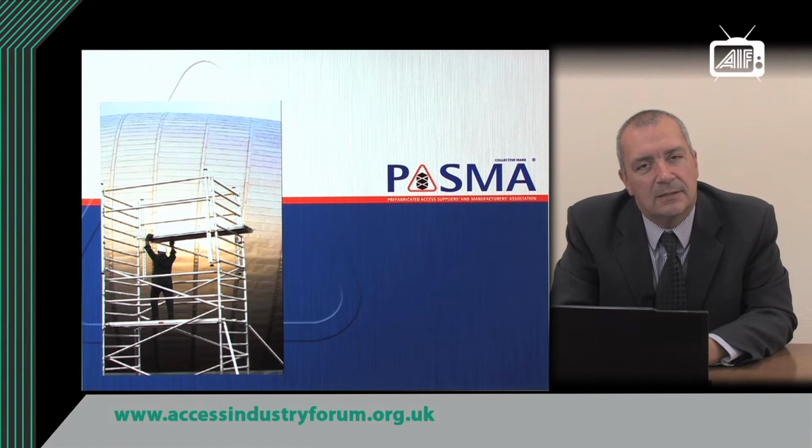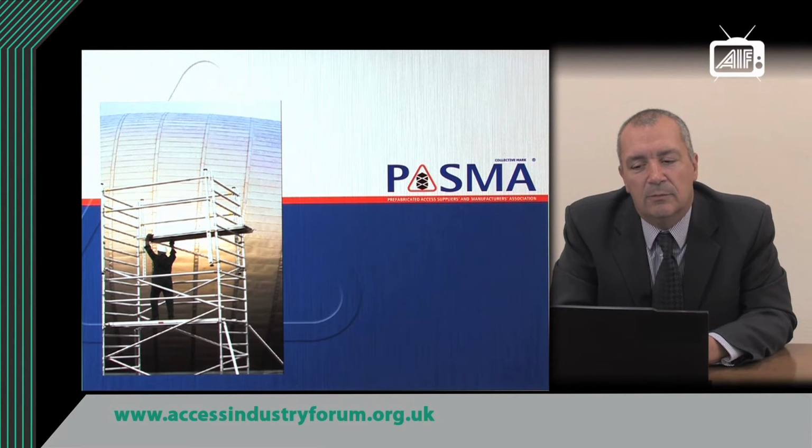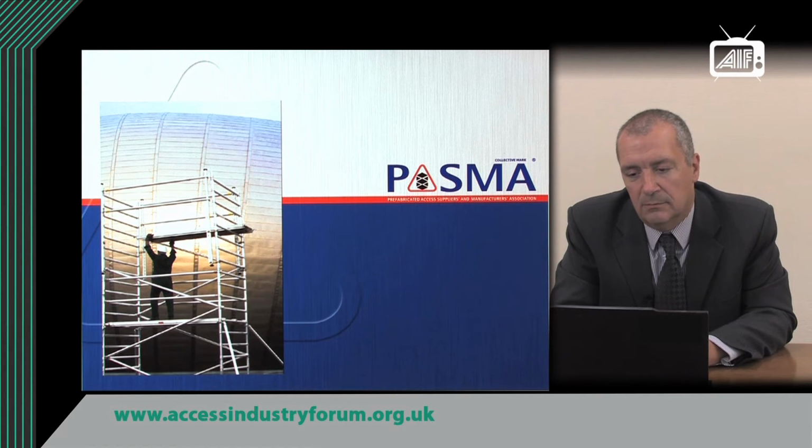Mobile access towers are different to fixed scaffolding. They're modular in design, they're very quick to build and dismantle, and when fitted with caster wheels instead of base plates, they can be moved easily around in the workplace at different positions at different heights in difficult access areas. I'd like to spend a few minutes today talking about some of the issues we often get asked about.